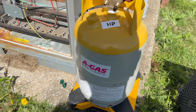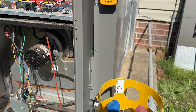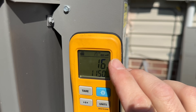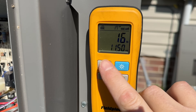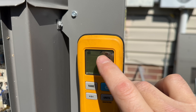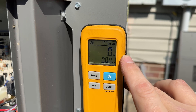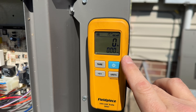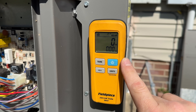What's cool about this scale is you want to weigh the tank before you add any refrigerant. It has a separate function here for gross weight. I can hit the tare button and it's going to clear out that section, but it keeps the gross weight up there so you don't have to remember what it was. As an empty tank, it's 17 pounds. And then we can also measure how much is going in here as well — pretty cool feature.